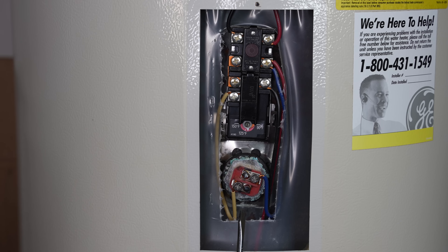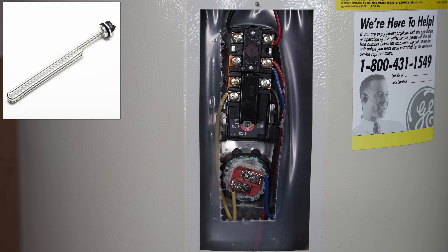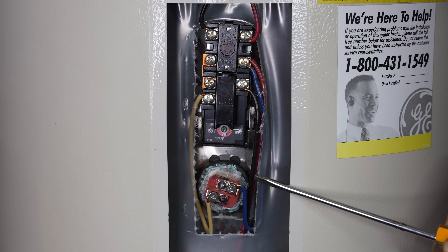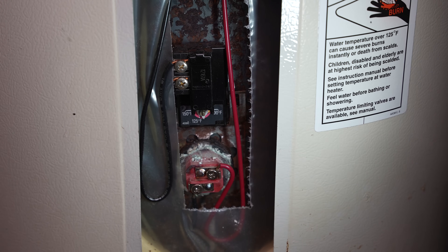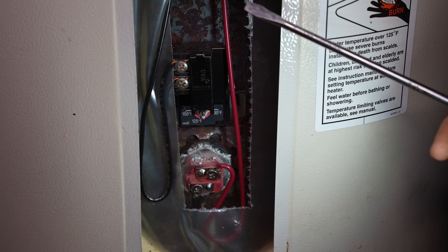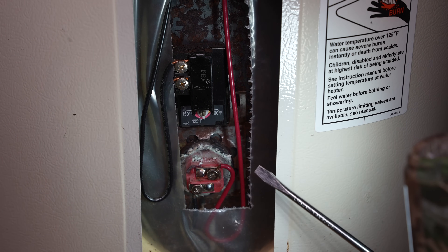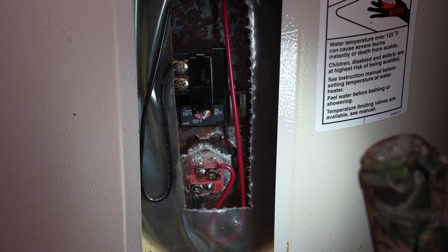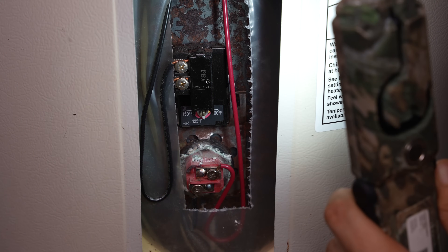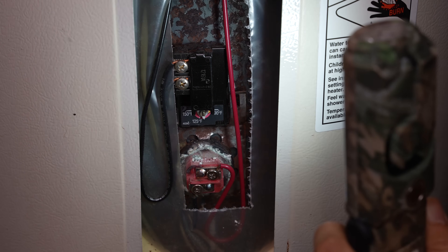Right here we have our upper heating element, which just screws inside of the tank — it's a really long element that almost goes all the way to the other side of the tank. Once the thermostat sends power to the element, it heats up and starts to warm up the water. If we look at the bottom, we also have a thermostat and a lower element down here. This one does not have a resettable button on it, but you can adjust the temperatures on this one as well. The lower element has a bunch of corrosion on it too. It seems like every single opening on the water heater has corrosion — I wonder if this is just a Hawaii thing, more humidity here. The tank is starting to rust on top as well, but as long as there's no water leaks, all is good.